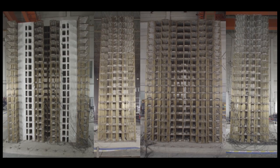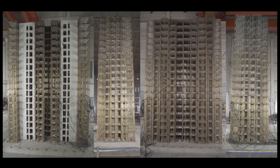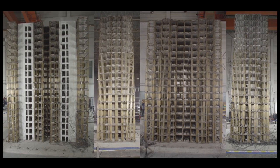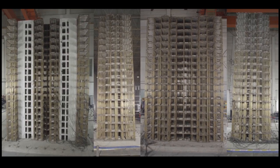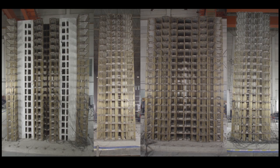As part of our research into the modules, we undertook some shaking table tests — a 1:8 scale shaking table test for the Vision system. This slow motion video gives an idea of the deflected shape of the building as it moves. In real time, you get a better appreciation for the trauma that the system is put through in a seismic situation. The system passed for a seismic intensity of 8 or 9, classified as either heavily damaging or destructive. The only consequence for the system is more robust connections for the higher forces and localized rebar detailing.